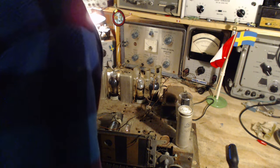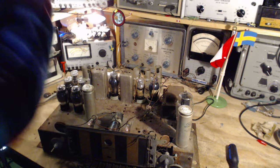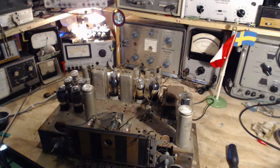Looking at the tube heaters at this point, considering how bright these bulbs are, let me turn down some more light. I'm going to turn it right off because the dim bulb is producing enough light. Okay, so now you can see the two light bulbs pretty easily. I would say none of these tubes are showing any heating effect yet. Nothing. Okay, so since this is a good indication the lights are on, we're going to raise the supply voltage and current by screwing in the other dim bulb, because this is probably dropping. There's probably nothing left coming over here. These will get brighter right away. There we go.